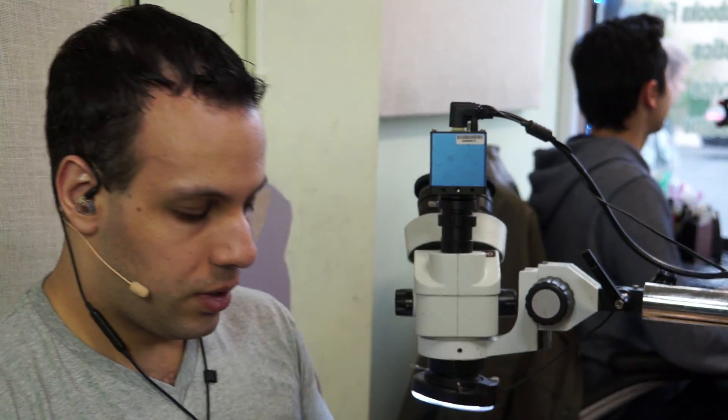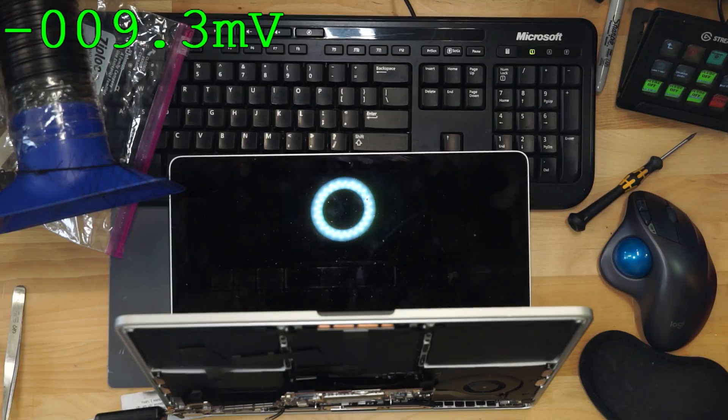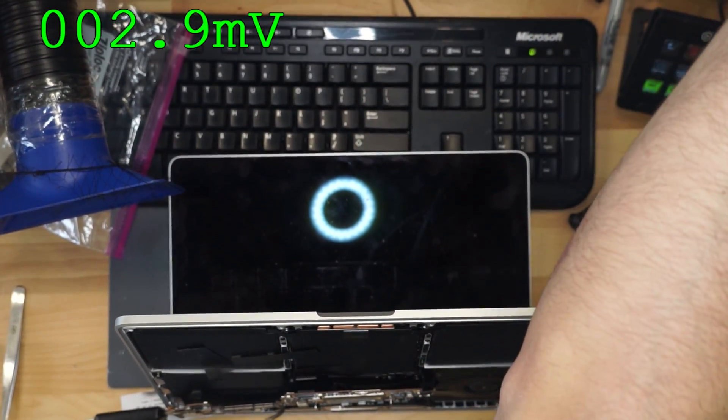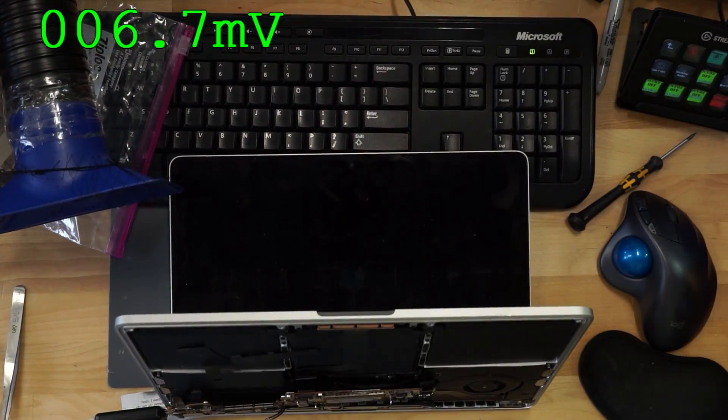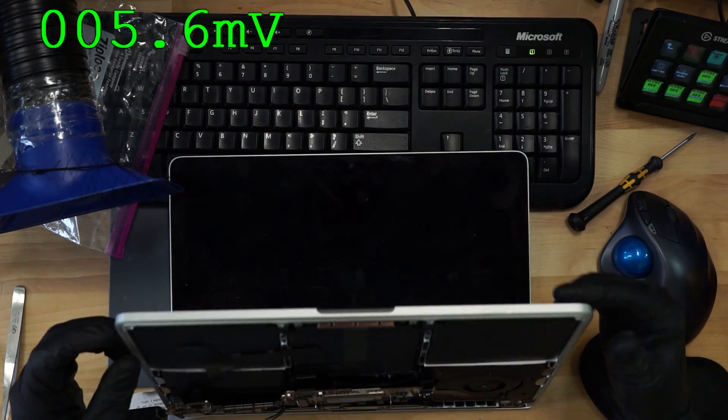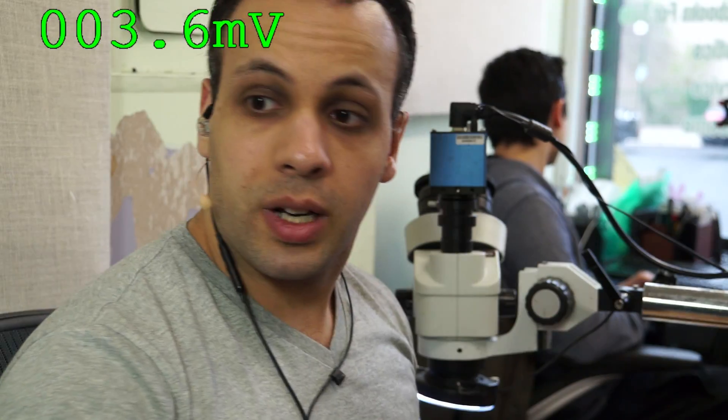Let's see if this gives us a picture on the screen. This light is actually blowing out the MacBook's backlight so you can't see it — but there's a question mark folder there. If I boot it into the operating system I'd be able to raise the brightness. This board has been fixed — it just needed that one little capacitor knocked off. Another machine saved.